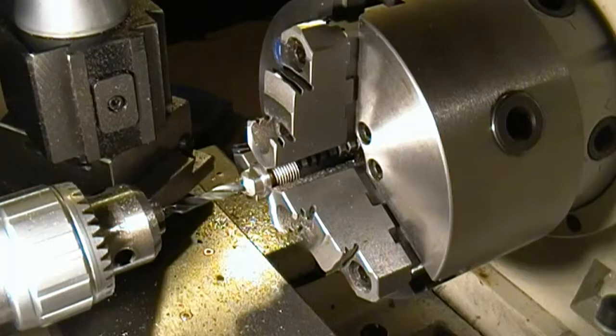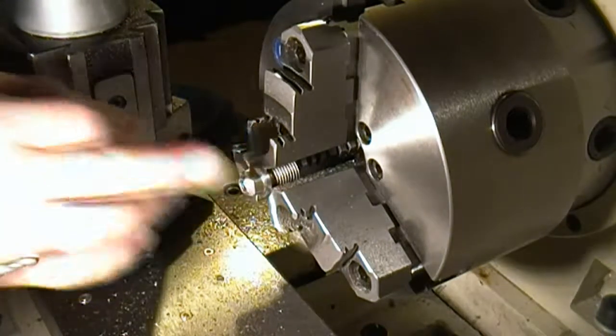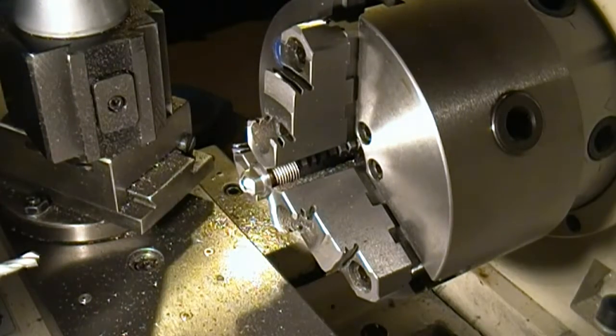The first step of our breech plug conversion is complete. What we've done is center drilled and drilled all the way through the bore — we're opening the bore up. The nominal measurement on the bore is going to be between .376 and .377. We've progressively stepped it up with letter bits, and the next step I'm going to run a ream through it, open it up a little more, then step-drill it some more.